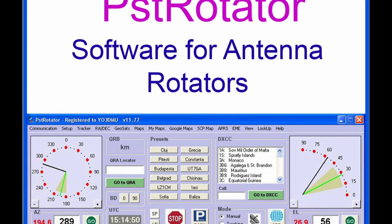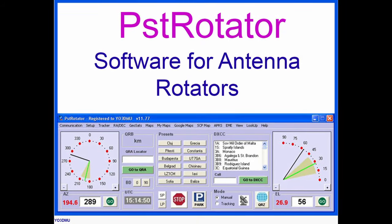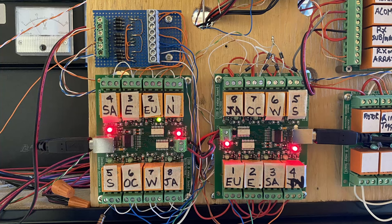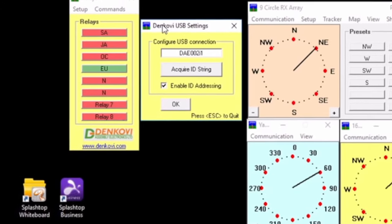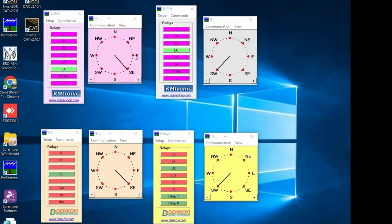How do I switch all this? One of the best ham programs ever is the PST Rotator program by YO3DMU. I use the relay function in this program to drive these 8-port Ethernet relays. I used to use the Denkove USB boards, but they can be problematic to set up, whereas these Ethernet boards are always visible on the LAN. I made another video about how to set these up, and I'll put a link to that in the description below. The PST program allows you to open multiple instances — one for each RX antenna. I have one for my 9-circle receiver array, one for my 8 directions on BOG channel A and BOG channel B, and also one for my 160-meter transmitter array.